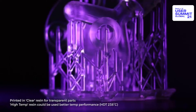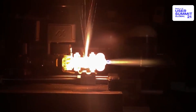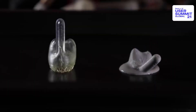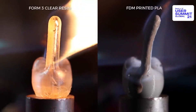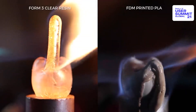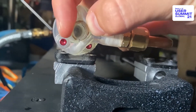This chamber was 3D printed in resin on a Formlabs Form 3. As we test, the nozzle throat slowly erodes due to the high temperature. If we were to 3D print this on a normal FDM printer in thermoplastic, the parts would melt and become unusable as soon as they became warm or hot. This shows the difference between a resin print and a thermoplastic print on a hot plate: the resin part keeps its shape but the plastic part melts. Under a blowtorch the resin part ablates — it burns away a surface layer but remains mostly intact — while the printed thermoplastic part melts and loses its form. Printing this small combustion chamber in resin allows for short test firings while avoiding the very high cost of metal 3D printed parts. As you test for longer the nozzle throat slowly erodes, but you get a good few seconds of testing before it does.